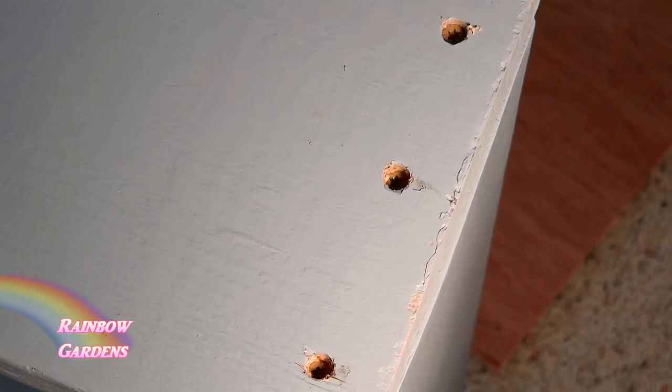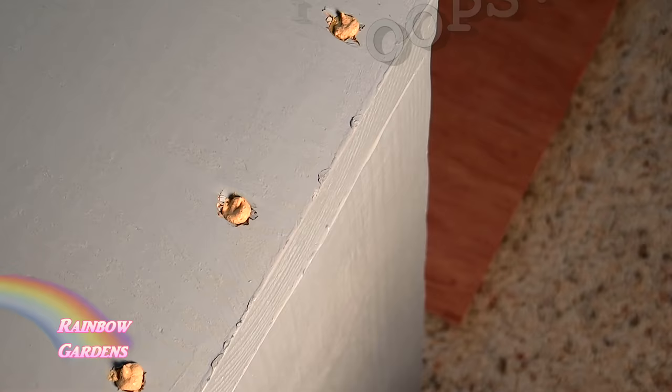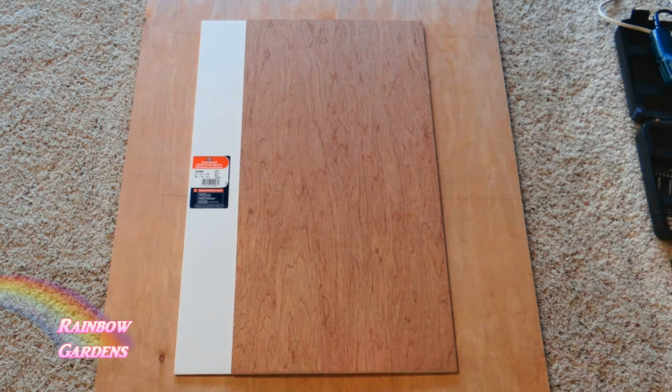When you're making your screws a little bit lower than the actual surface of the wood, now we're just going to fill it in with some wood putty. You can keep it a little bit high because we'll just sand it off later — make sure it dries real well and then sand it down. I filled in my cracks and the screw holes and then painted over it to keep it nice and neat.